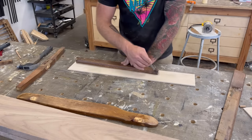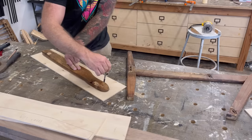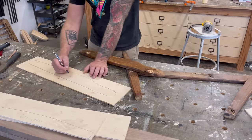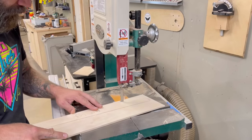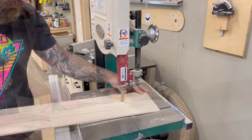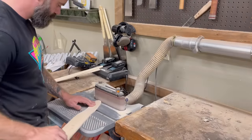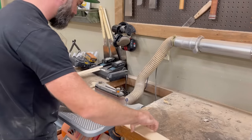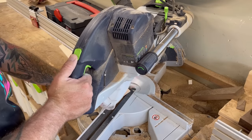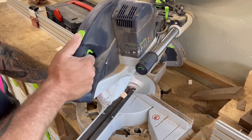Then I could take each individual part and trace it out onto a piece of quarter-inch plywood. These shapes don't have to be exact — we are building a new chair, so we're pretty much just using the old pieces as a reference. It will be slightly different, but that's okay, because then it will be unique — like a snowflake. After tracing out each individual piece onto some quarter-inch Baltic birch ply, I went over to the band saw and roughly cut out each shape, just coming right to the edge of my pencil line. We're going to clean this all up on the oscillating belt sander. The only really important parts are the top and bottom cuts, because those have to be perfectly straight so it sits level on the floor and your armrests sit level on top. For those cuts I used the chop saw.